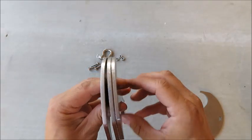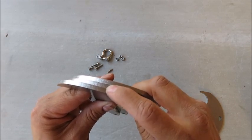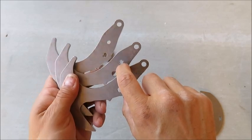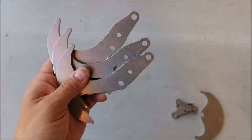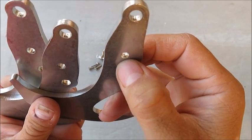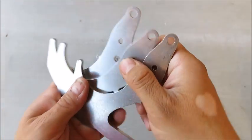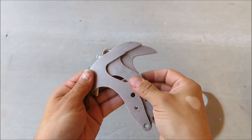The hammers are already in a particular order. There's a blue mark on the center of one hammer — you want to keep that hammer in that position because that locking pin hole was drilled out. If you've already mixed up the order, look inside the locking pin holes: the front one will have a burn mark from the laser, but the center one will not because it's been drilled out.